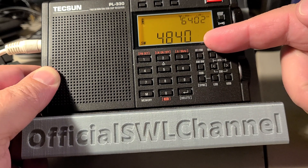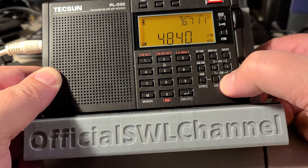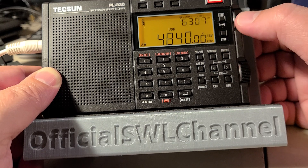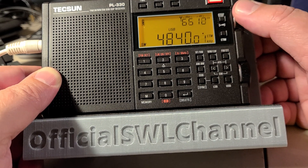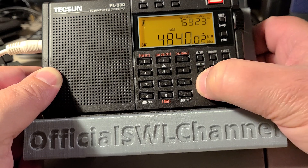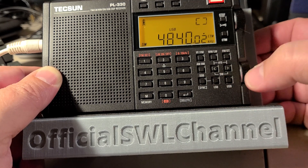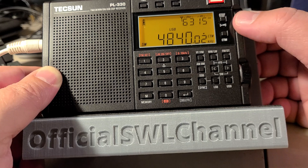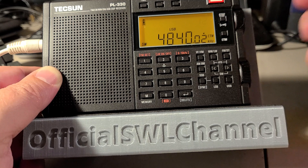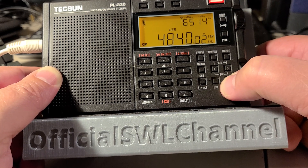Listen to the voice, listen to what's playing. Put yourself in upper or lower sideband — I'm choosing upper sideband. Tune it until what you listen to sounds pretty much the same as the AM audio. This seems pretty close right now. Once that is done, press the LSB or USB button — doesn't matter which one — and hold it.